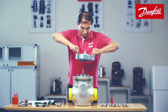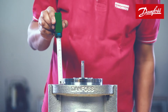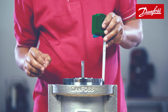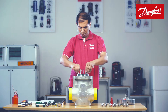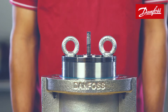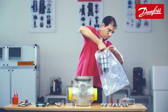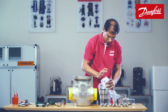Unscrew and remove all top cover bolts. Lift the top cover using a screwdriver and remove it from the valve body. Measure the distance between the valve body and module insert top. With the help of a screwdriver, lift the module insert and remove it from the valve body using eye hooks. Place the module insert inside a polythene cover to protect it from atmospheric dirt.